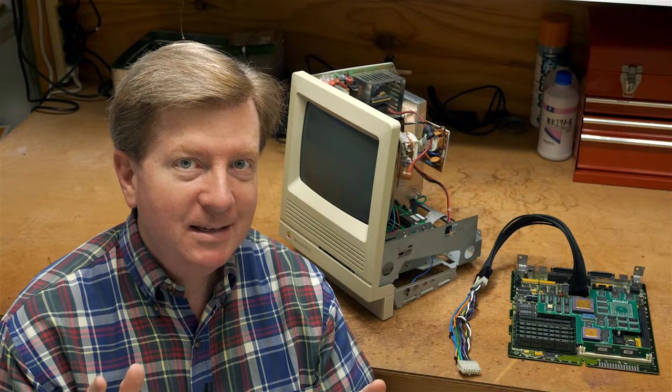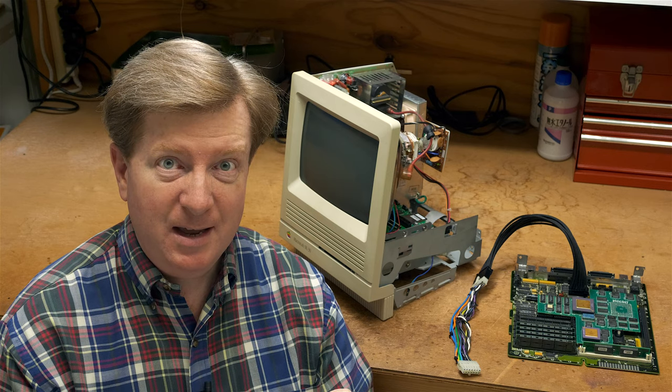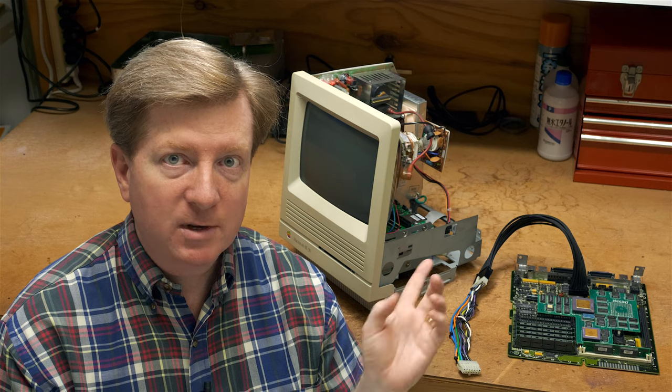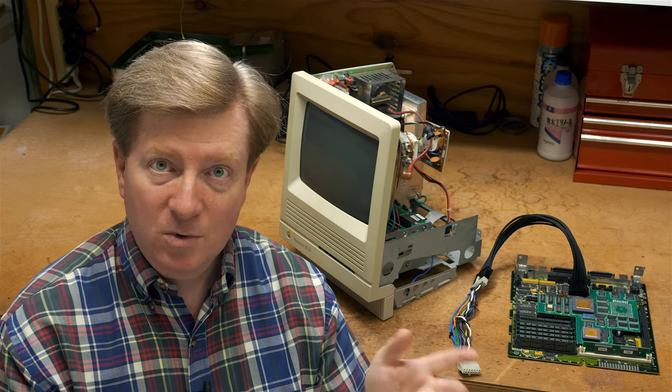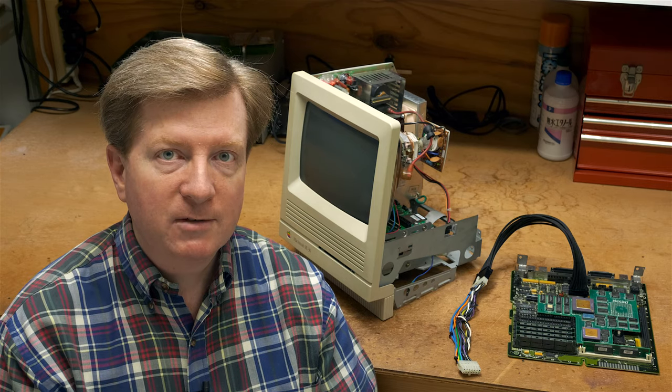So what does all this mean? Basically, electrically speaking, everything is okay. We know that the stock cable, despite looking like an 18 gauge cable, actually has quite thin 22 gauge stranded wires on the inside. The fact that we have a known 18 gauge extension cable, which is thicker, is just fine — because whenever you extend a cable, you always want to go thicker than your stock cable. If you use the same 22 gauge wire to extend it, you will add resistance, and when you add resistance you experience a bit of a voltage drop. To eliminate or lessen that, go with 18 gauge or even better 16 gauge. If you use 22 gauge, it will still work — you're not going to get a substantial voltage drop that would prevent operation. It's just that if you can, get a thicker gauge.